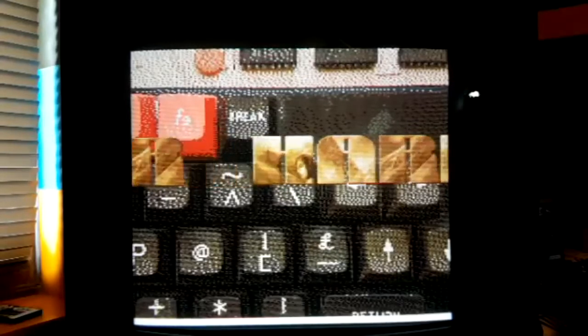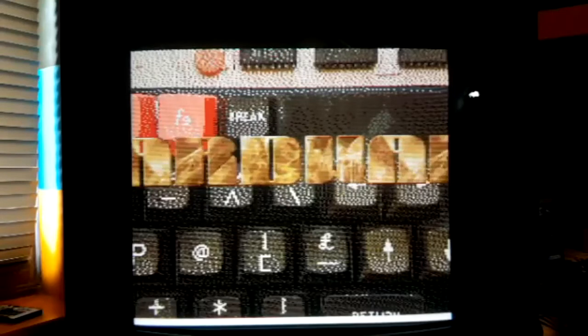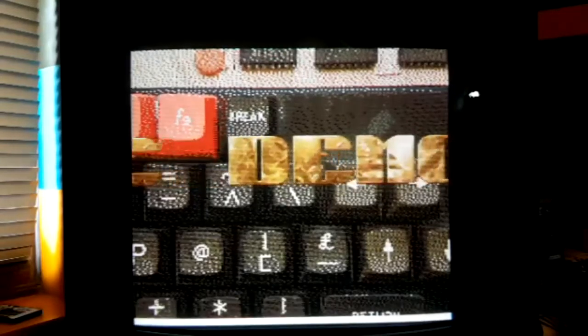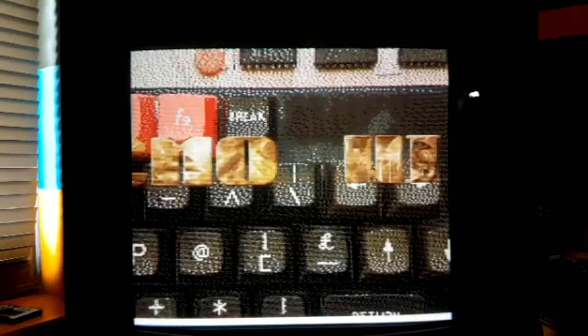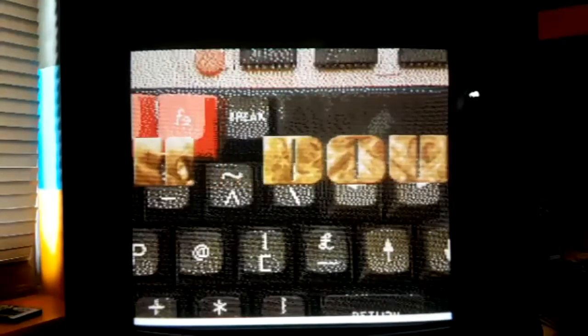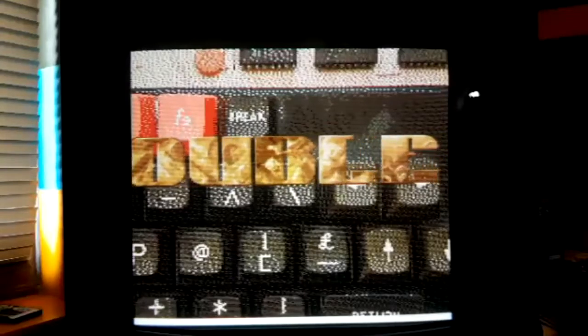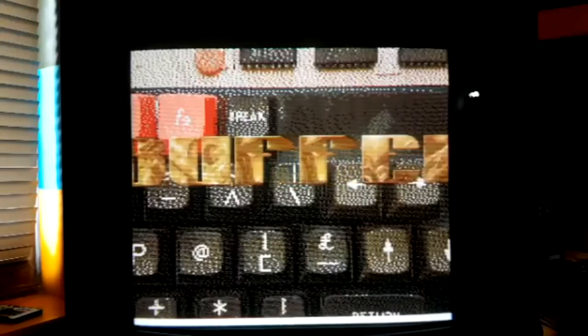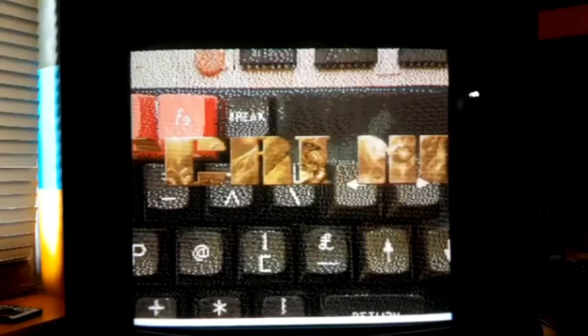Some of the processors we've got there, like the 68008, when it says it's running at 8 megahertz, effectively it's really running at 2 megahertz. It takes 4 or 5 cycles to do one memory fetch. So I think we'll do questions at the end, so I'll not blather on about this anymore, and I'll show you something else.